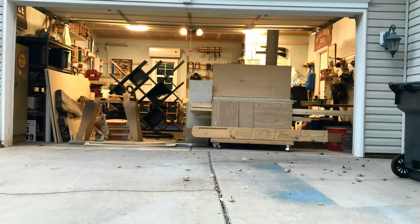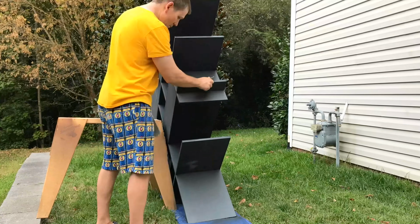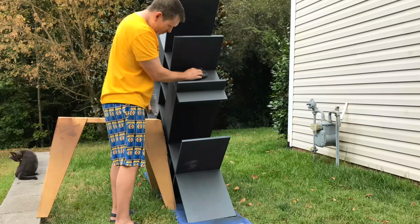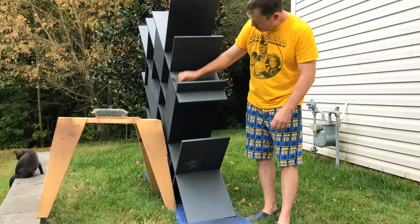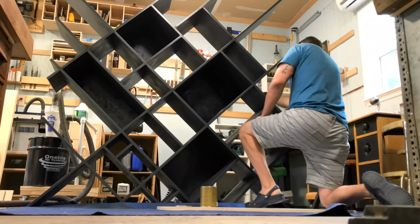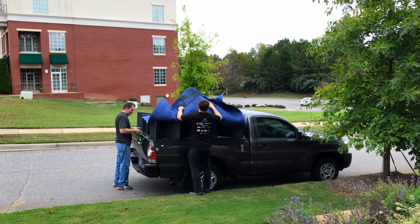I had to do a lot of sanding with steel wool. I used a total of 4 bags, which is 48 pads of steel wool. And that's mostly because of the fine dust from the spray paint. And then to make it more durable, I finished it off with 3 coats of Minwax fast drying polyurethane clear satin, and I sanded with the same steel wool in between each coat, and then sanded it all one more time with the steel wool after it was all finished.